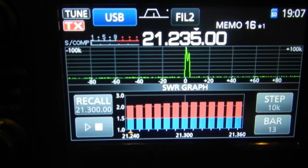I think the antenna's pointed roughly north — don't quote me on that. I've literally got it up on a small push-up mast to do some tuning. I've just got it at the recommended settings. I've only tuned up on 20, and I just moved to 15 to check the SWR there, ran into you, and I obviously haven't made it to 10 yet. I don't even know if it's pointed in your direction or not. They seem to suggest that the side rejection is not that great on these, but yet to be tested.